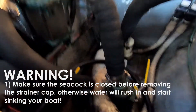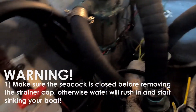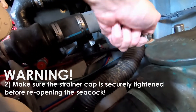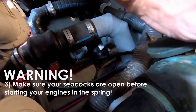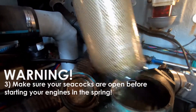The raw water comes up — the river water comes up through this hose and into this strainer. I'm going to take the top off the strainer. Just loosen these up, and then it should open up like that. You can see there's an actual strainer in there, and it's dirty at the bottom because when you go in shallow water, you suck up a little bit of sand and mud.